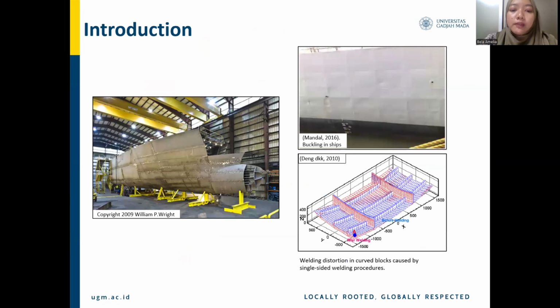Welding, widely used in shipbuilding, creates strong, efficient joints but faces issues like distortion and residual stress on thin plates. These factors weaken the structure, making it prone to fatigue and failure under dynamic loads. This requires welding to have strict procedures to prevent failure. One of which is the flux core arc welding method that is commonly used in ship welding. Although distortion can be reduced, it can still cause residual stress. For this reason, the flux core arc welding method is combined with the preheating method.